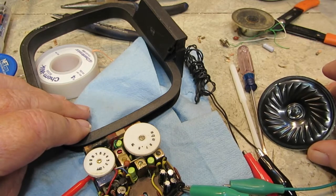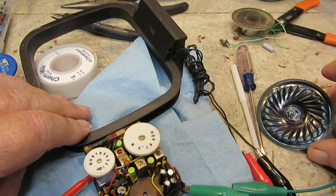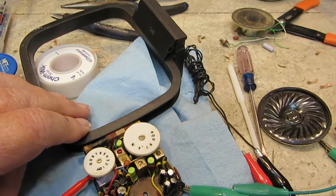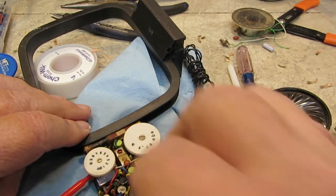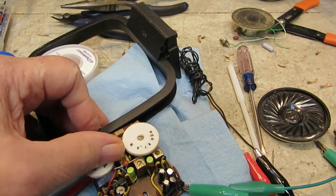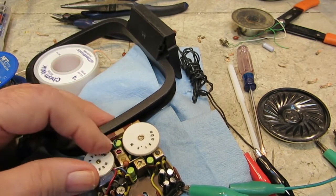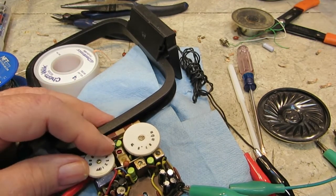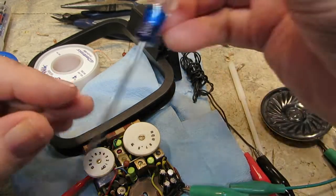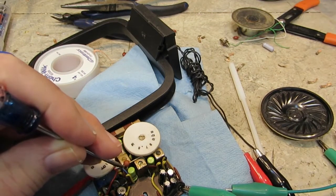That is the HP signal generator, generating a 455 kilohertz tone, or signal, with a tone. And you hear, I can turn it up or down here. So you can hear it's making it through the radio just fine. That means that the radio itself seems to be working. Now I did notice while I was playing around with it a while ago, if I pressed a certain spot, I got some different things. Like this one here. You hear that?